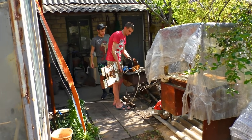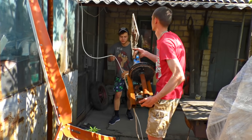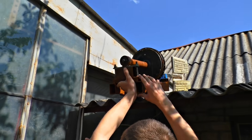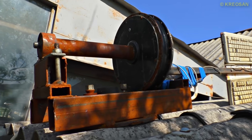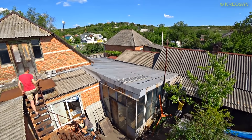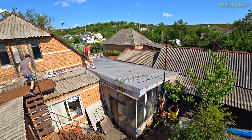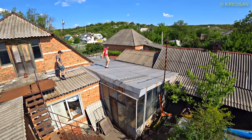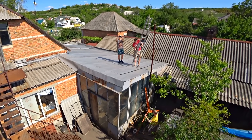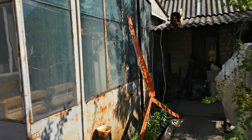We've made it and now comes the installation process. We don't want it to fall again, so we are raising it in two parts. There comes the motor — the one we made last time out of an electric bike motor. This motor suits perfectly because it has an awful lot of neodymium magnets and windings, so it will give us much power out of slow torque. First we are attaching the motor to this mast, then we will connect the blades to it — the 1.5 meter blades.